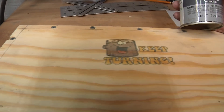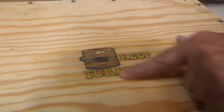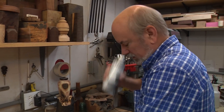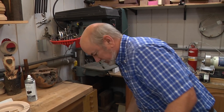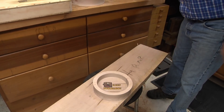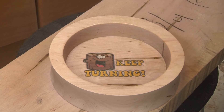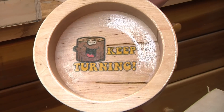What do you want to put on this for protection? I did a test here. This right here is top coat satin Valspar lacquer that I put on there. On this one over here, this is hand-rub polyurethane — you can see what happens: the black starts bleeding into everything, so it's not the best option. You just want to take the lacquer, shake it up really well, and spray it on there to protect it. Then you'll have a really cool inkjet transfer on turned wood. Until the next time on woodturning, keep turning and transferring.